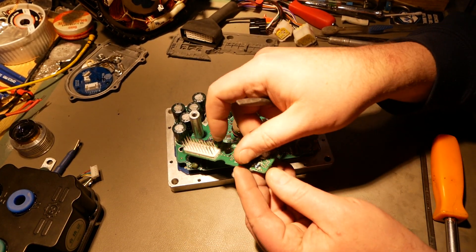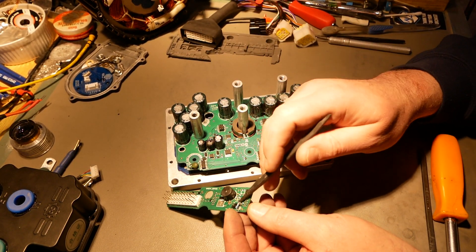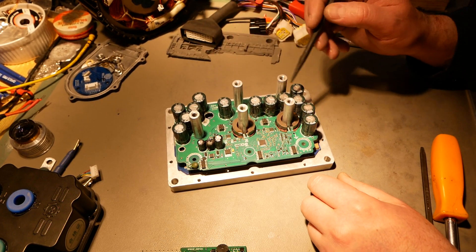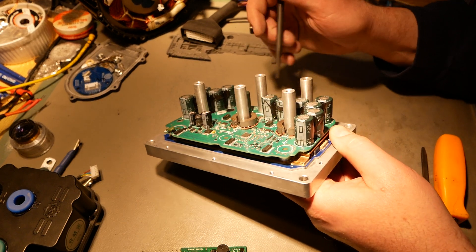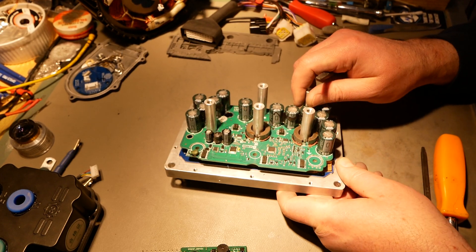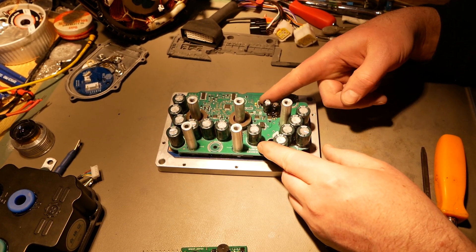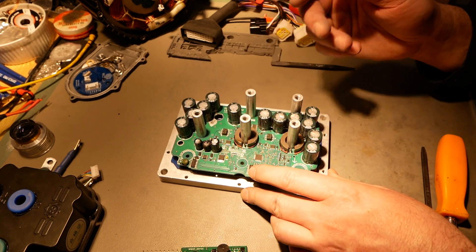This little resistor here was also buried in potting, and since it's now not, I put a little silicone on it to hold it down so it couldn't break off. All these capacitors — same thing. You can see all the black silicone around here — that's from me. Those little parts are all pretty much secured in place now and they're never going to vibrate and break off their own legs.